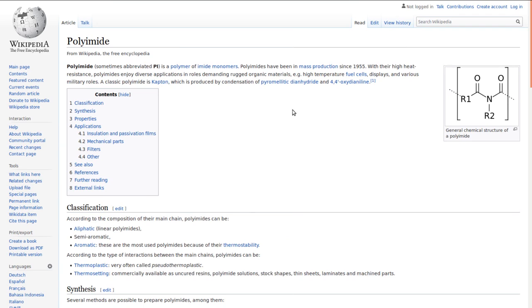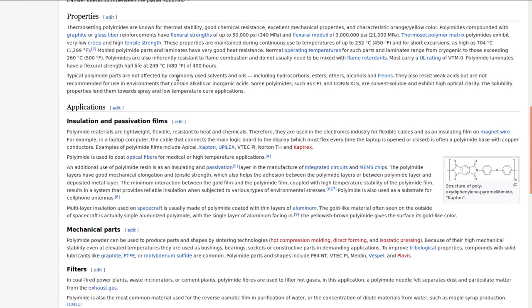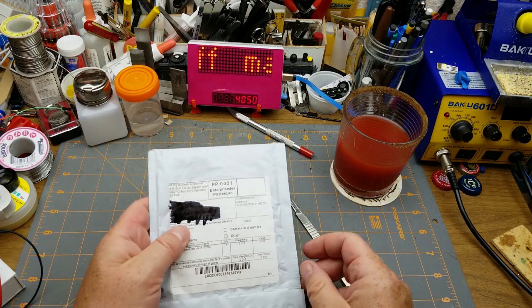The benefits of Kapton tape are: it's electrically insulating, very heat resistant at high temperatures, really quite thin and strong. Long-term temperature resistance is 260°C, short-term 300°C — that's soldering temperatures. This one is 30 meters or 100 feet long. The actual material is polyimide — I'm sure somebody who speaks chemistry will correct my pronunciation. Polyimides have been in mass production since 1955; the classic brand is Kapton. Stability down to minus 260°C and up to plus 400°C. It's also not really affected by a lot of solvents, oils, hydrocarbons, alcohols, or weak acids. Oh — you can use it as a photoresist, which could be handy for circuit board etching.